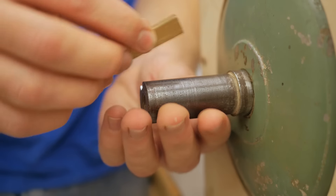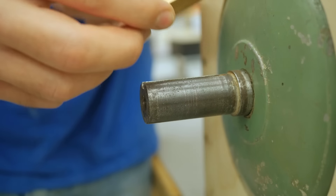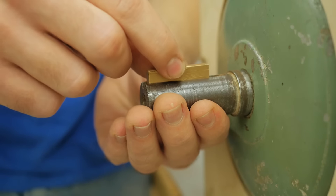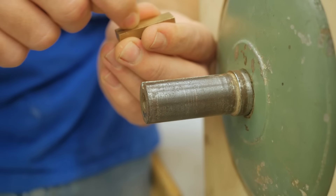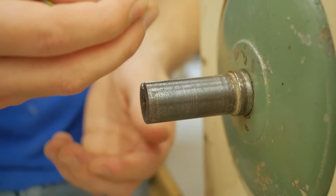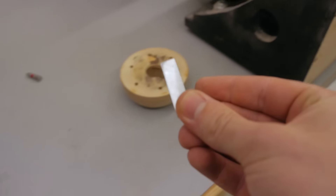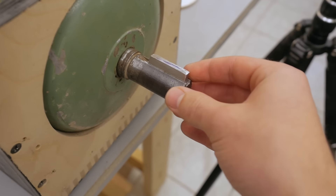So I made a bigger one, but unfortunately I made it out of brass because I had a scrap piece laying around that just had the perfect thickness. But now after two years of use the fit is just horrible because the shaft dug into the brass - it's just the wrong material. So now I made a new one out of this piece of steel angle. It's still not the best material, but at least a fair bit better than brass.